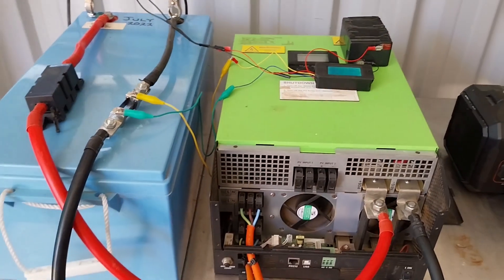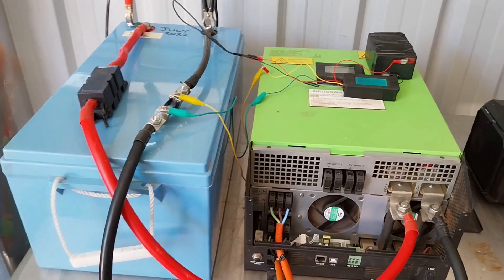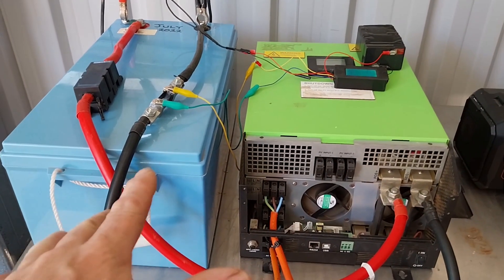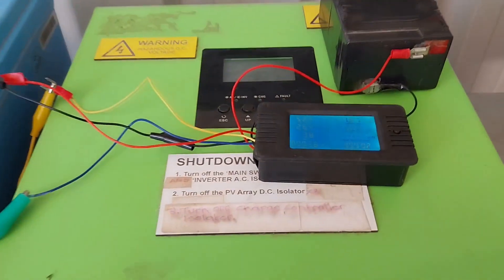What I'm anticipating — which happens pretty well every time I do these tests — is that the inverter will generally shut off at low voltage disconnect before the battery BMS shuts off. That's not a huge problem because by that point the battery has hardly any power left anyway, so it's pretty close to accurate. Now I know some people will say you have to do these tests at the C20 rating, and 26 amps is not the C20 rating. However, the difference between 20 amps and 26 amps on a lithium battery with very low internal resistance means that extra 6 amps isn't going to make any real difference to whether we pull the full capacity out. So we've started our test — let's see how many amp-hours we can pull out of this battery after three and a half years of daily cycling.